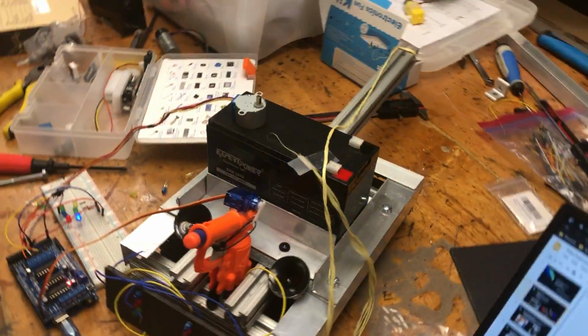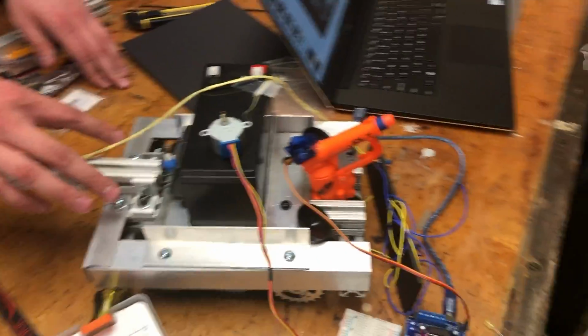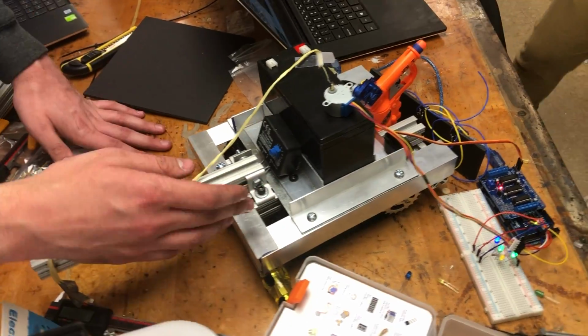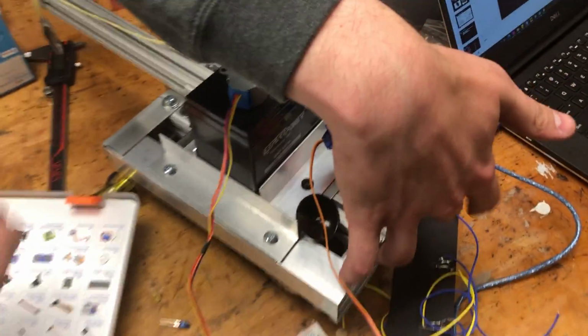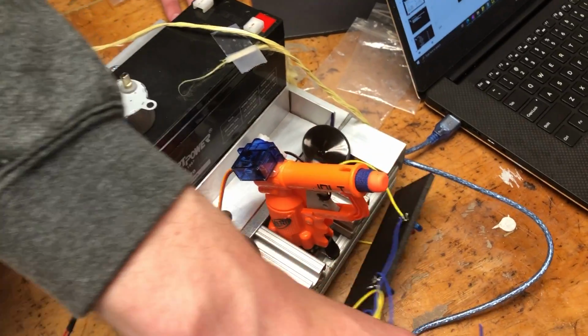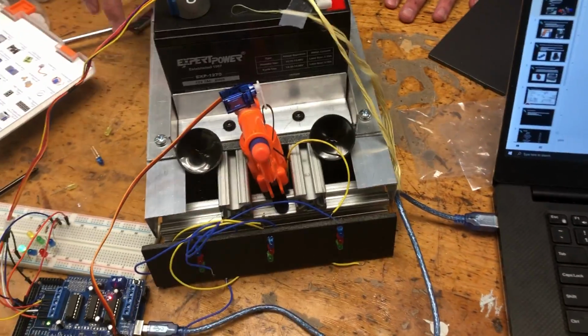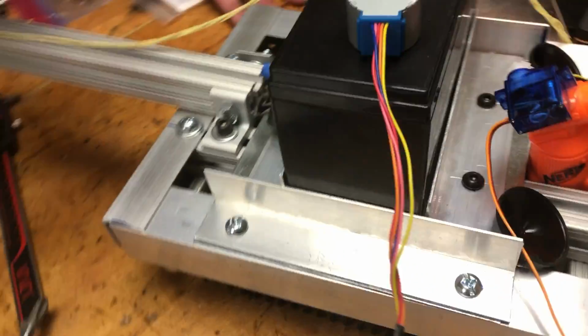So we had this done before coming in here today, and so we went to pick up the aluminum here, and we were able to fabricate all the extremities for the chassis. So we added these 2 main rails here out of 80/20, and this pretty much combined with a sheet metal base formed the main chassis of our robot.